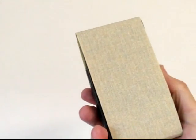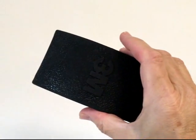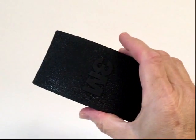At this point, since the spackling paste is pretty rough on the wall, I'm using about 100 grit sandpaper and putting it on a sanding block to begin the sanding process.